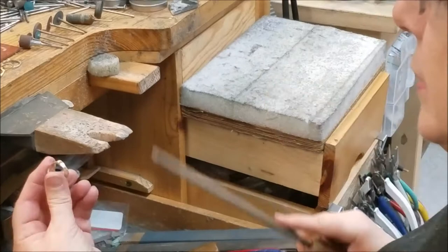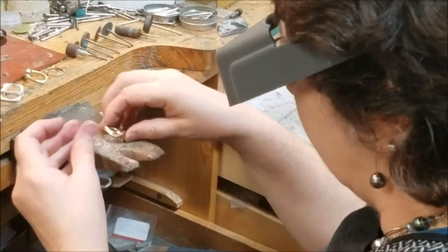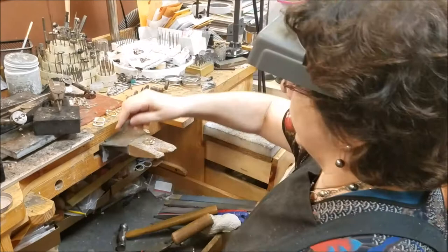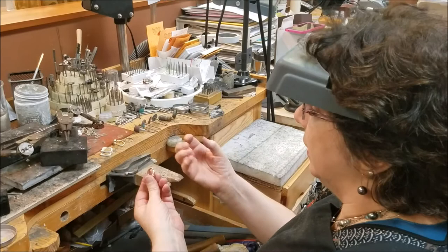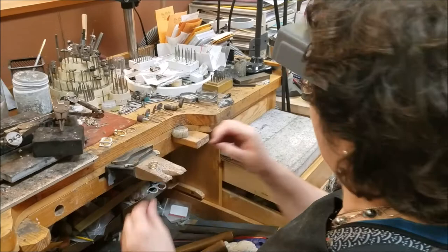The next thing is to go to the inside of the ring and finish it. The reason we do that is because the inside is ultimately going to get a quality stamp and a branding stamp — a Trios and a 14-carat stamp. If you go in and hammer the inside after stamping, you'll mark the outside of the ring with an impression of what you're hammering on, so you'd have to go back and clean up. In order to not backtrack, finish the inside first.